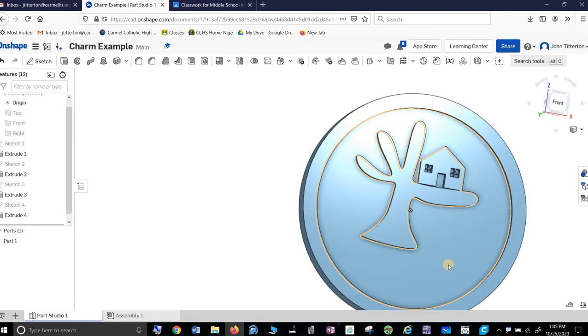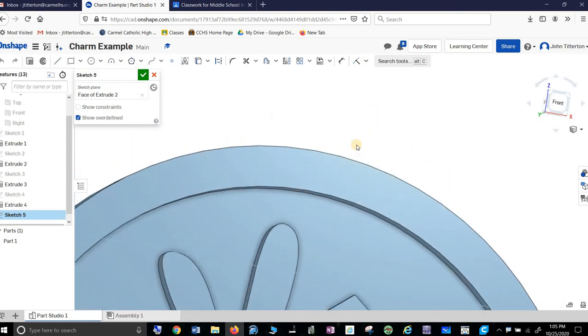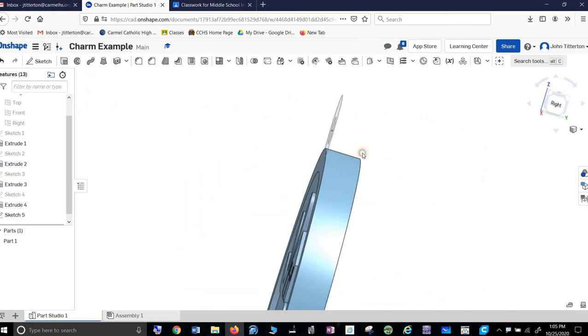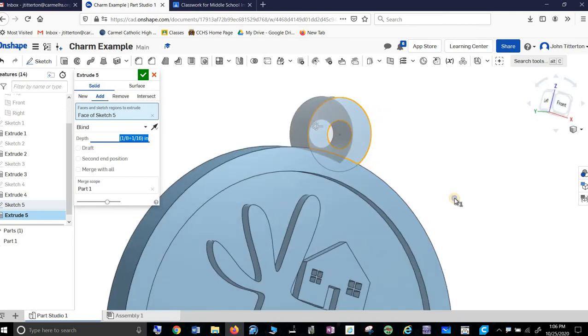Now I'd also put my initials on there, but let's put a little loop up here — no idea what I'm doing again. Let's go on this plane, sketch, and just slap the circle out here. I think I made it 3/16 of an inch thick. I want it to overlap — do the inside one, then circle. Finish. Let's extrude you the other direction — I think it's 3/16 of an inch, because I think I made that 1/8 and that 1/16. One-eighth plus one-sixteenth — holy cow, it is right. Lucky guess.